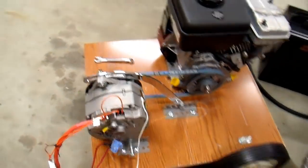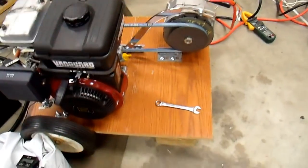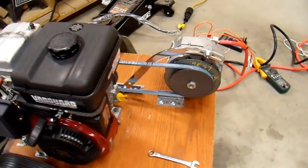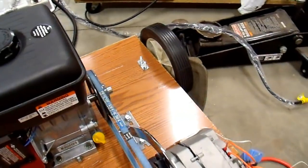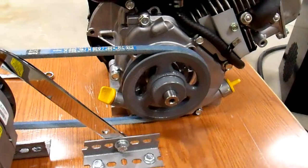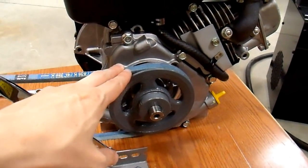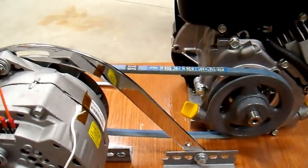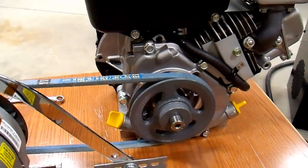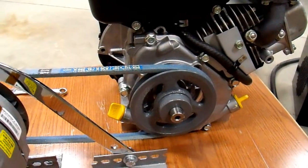I just wanted to give this little update of my pulley size change, and say that if you're setting something like this up, the 27SI alternator works out very well for this, and a direct drive or 1-to-1 ratio on your engine to the alternator is about the right ratio. I'm going to go back here and mention one thing about the pulley sizes. 1-to-1 ratio seems to work very well for this setup, however you do have to be careful about pulley diameters. And if you're watching my channel you're probably interested in some of the technical things.